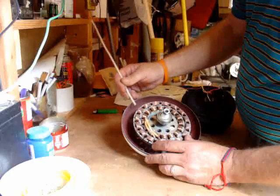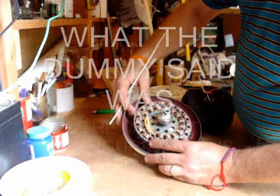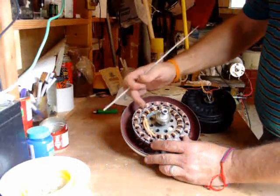The same thing on this one — because this was clockwise, counter-clockwise, it's still north, south, north, south. Don't go north and then north again, because those coils will all be wound the same way on the other one to have the gaps in between.